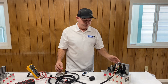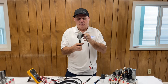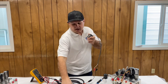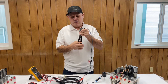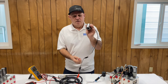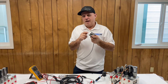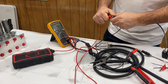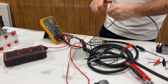Here's another test: just apply power and you can take a wrench and feel the magnetism. All this is is a coil of wire — current comes through and goes around the coil, creating a magnetic field that pulls the cartridge one way or the other and diverts the oil. It's really simple to troubleshoot. If you've got a dead one it's not going to hold. These generally run anywhere between 8 and 14 ohms, so you can measure them with a meter.